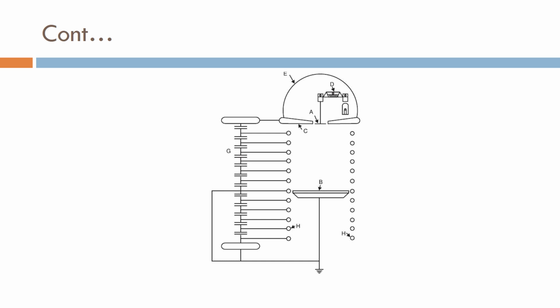In the electrostatic voltmeter, one plate is fixed and the other plate is movable. The force on the plate can be measured by suspension of the moving electrode on one arm of a balance, suspension of the moving electrode on a spring, pendular suspension of the moving electrode, and torsional suspension of the moving electrode. This is how the force on a plate is measured.